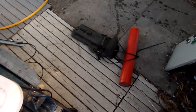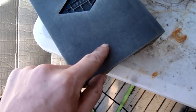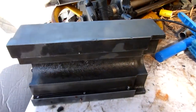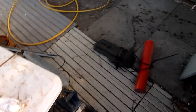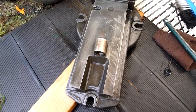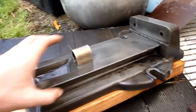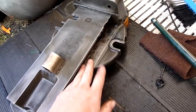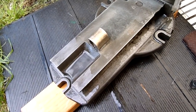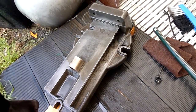I'm going to let that one cool down, wash it, and preserve it. I'll be able to stone all these nicks and things out of it and hone and lap it. The rust looked really bad but really there's very superficial pitting — that's good. The base cleaned up nicely. Again, everything's going to get a lapping stone run over it. Anything that's cast and not machined will get painted; anything that's machined stays raw.